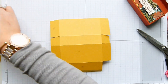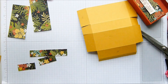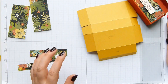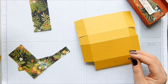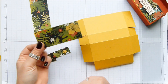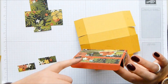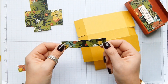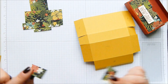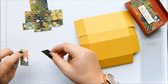Let's go with some measurements — don't panic about writing them down, it's all on my blog. In the description bar below you'll find a link directly to this project. You need two bits for the front measuring three and three quarters by one and three quarters inches, which is nine and a half by four and a half centimeters. You need one piece along the top: three quarters of an inch by three and three quarters, so two centimeters by nine and a half. And two for the sides: three quarters of an inch by one and three quarters, which is two by four and a half centimeters.